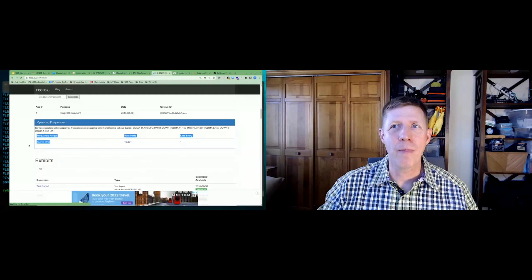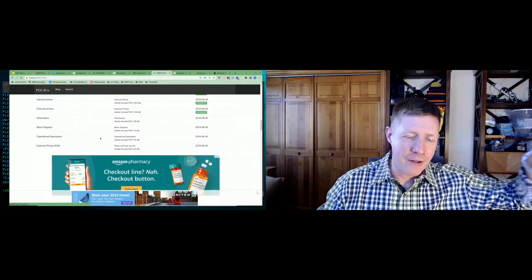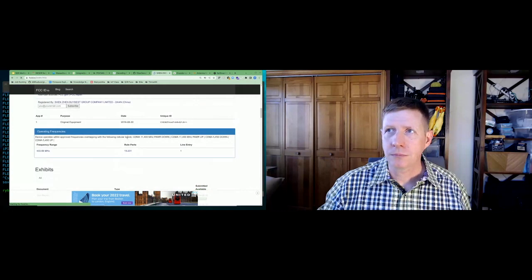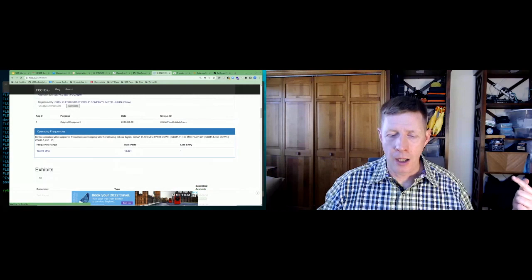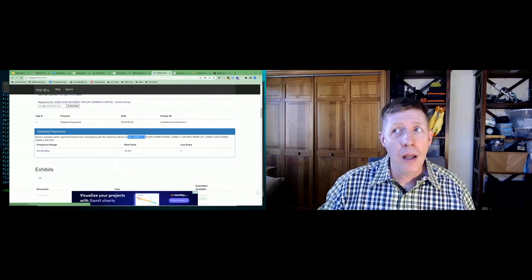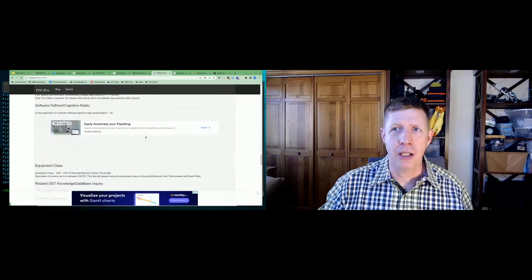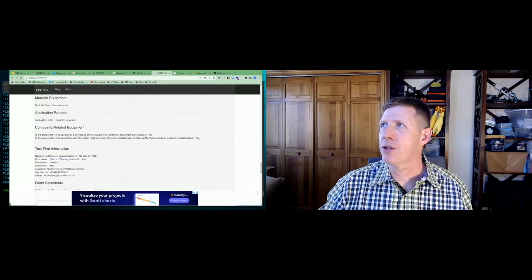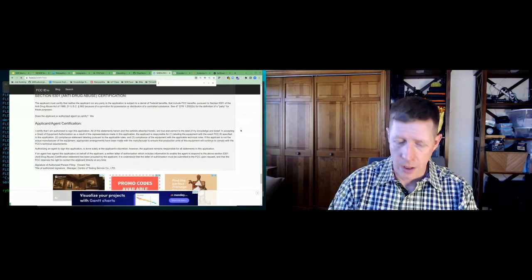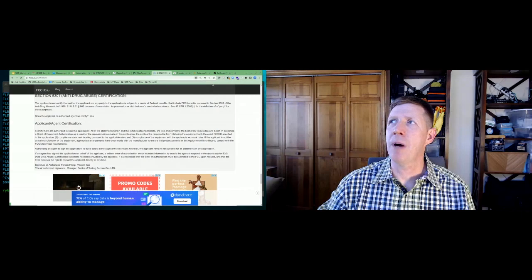The frequency range is 433.98 megahertz. And you've got all these different reports, test reports, block diagrams, information about the device. What I really care about is what frequency does it use? And modulation, if it tells me, does it use AM, FM, all of that stuff, that helps out a lot. And any other thing that I can use to actually decode it. I don't see modulation or anything. So maybe I could search for ASK, FSK, nope, FSM, nope. Okay, so I don't see any kind of modulation.